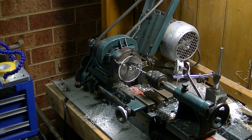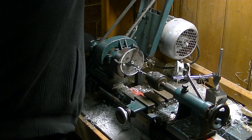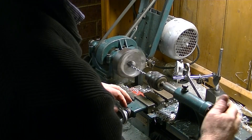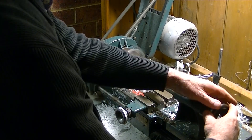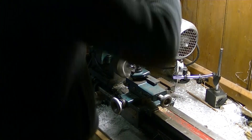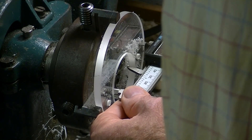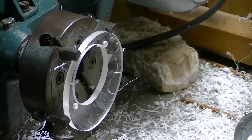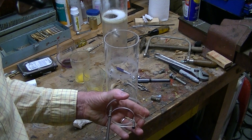I've centered this up to that center drill mark in the lathe. I start by drilling the first hole, then put in a boring tool and gradually work that out until it will take the tube that holds the piston. I'm nearly there at this point — it's all about going gently because I had to turn through that other hole in the middle. I'm measuring the internal dimensions to get a really nice fit with the perspex tube, and that is looking gorgeous.